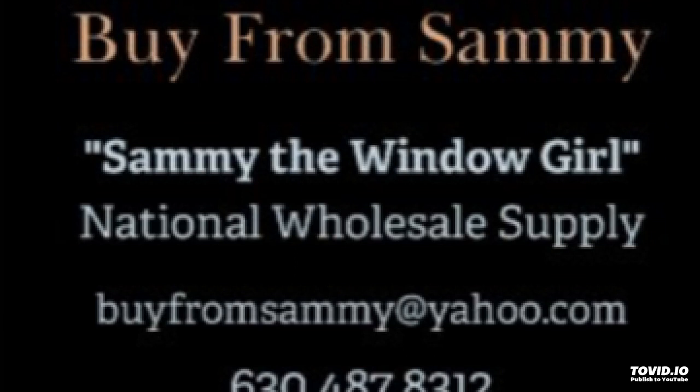Let's say you need two double-hung windows in the front of a house replaced. Your window installer comes out and says this is a twin double-hung unit. Your installer has an option — at least from my window line — to either choose a factory mulled unit or a field mulled unit. Sometimes you have no choice but to field mull, and that would be if you're doing an extremely large opening and it's a shipping restraint. I ship on semi-trucks, but I still could have limitations as far as the overall dimensions of the product, depending on the project.